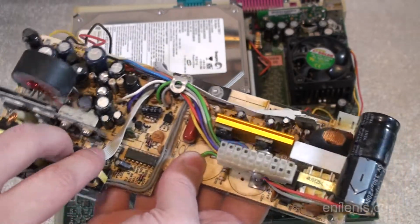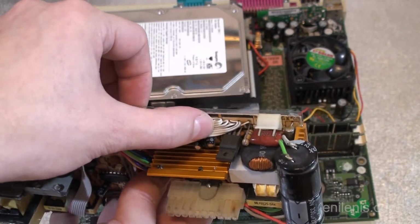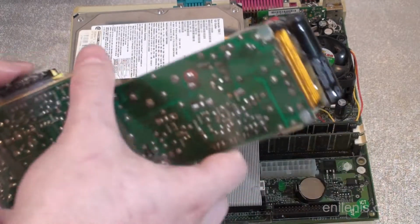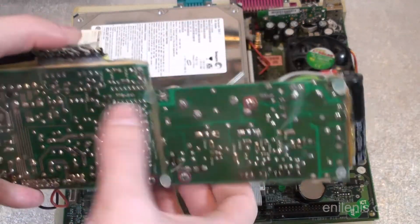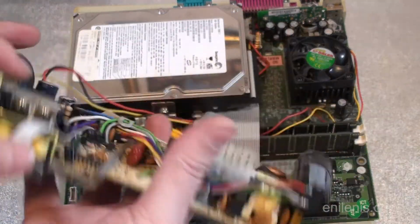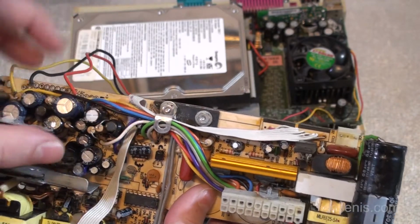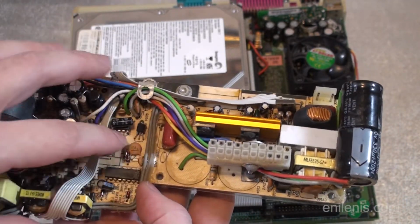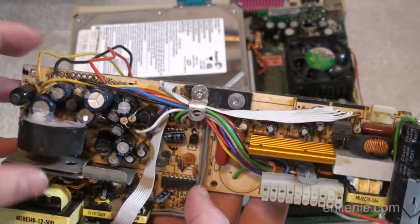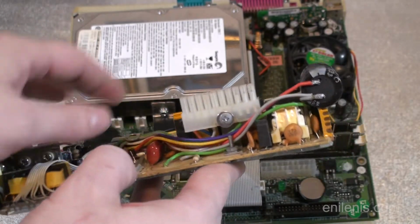So I got these power transformers being linked with these IDE cables to the place where their outputs used to connect on the board. So all I'm doing is just transposing this section onto that section, and no modification other than that. There are a few additional wires. I noted which other traces had to be removed when I did the split. So yeah, that's pretty much it.